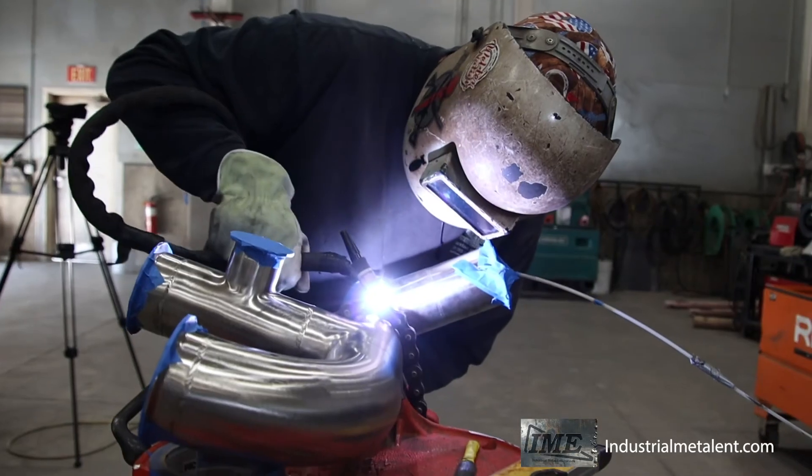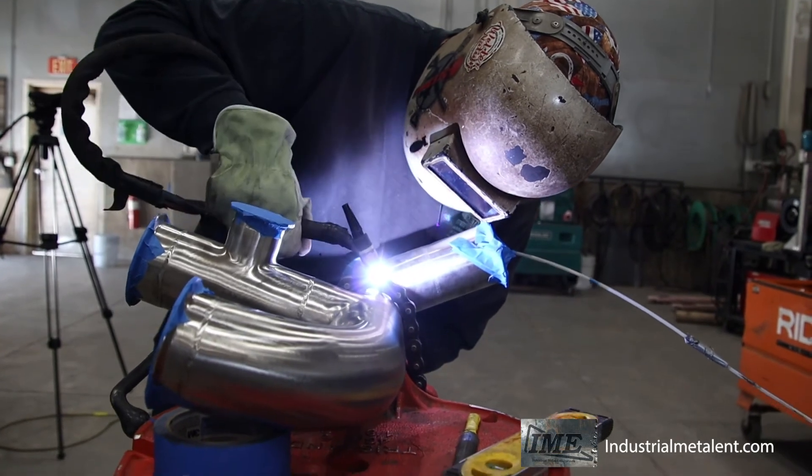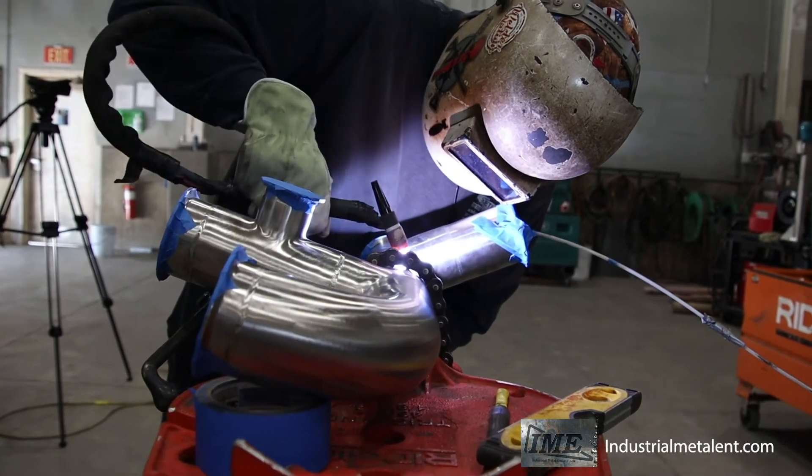I've done it all. I worked in the beverage plants — Coca-Cola, Pepsi-Cola — when I first started welding, so I learned that aspect of it pretty well as far as the welding goes. And you have to purge the inside of the pipe — you have to get the oxygen out of the inside of the pipe.